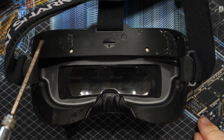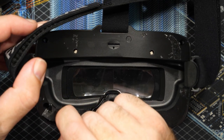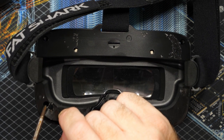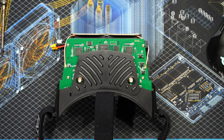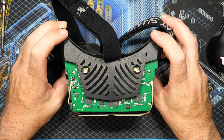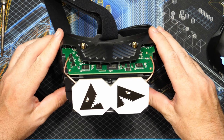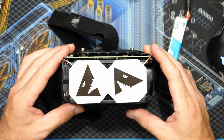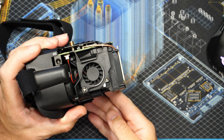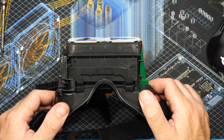Taking these goggles apart — to get into them you remove the padding from around the side, which reveals screw holes around the faceplate area: two under the bottom on either side and two along the top on either side. Once removed, you can pull the front of the goggles off, revealing the PCB on top with the antennas on the front and the coax coming over. You can clearly see the two large built-in right-hand circular polarised patch antennas, which even have little shark logos on them. On the left is the built-in cooling fan, which cools the internal electronics and also provides airflow over the lens.